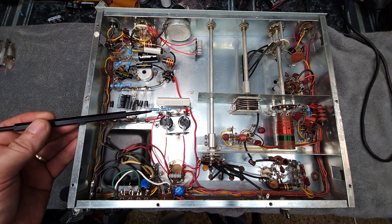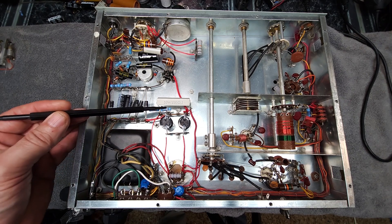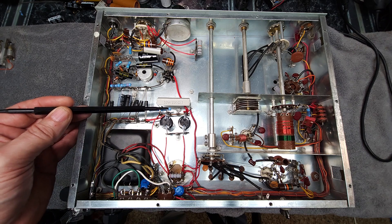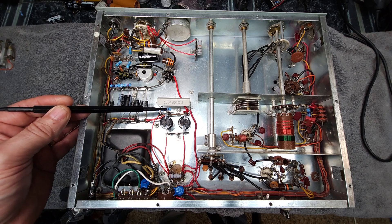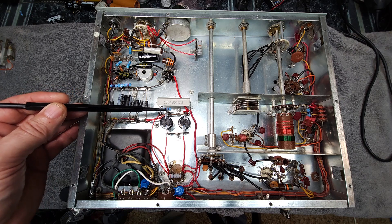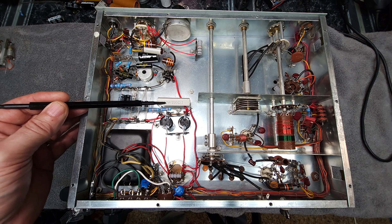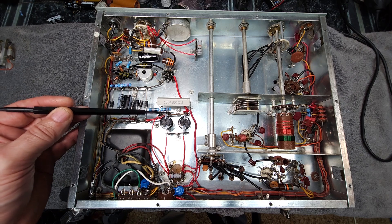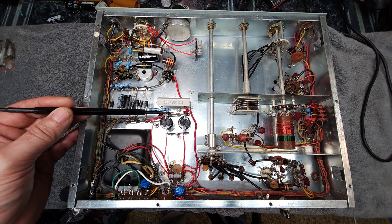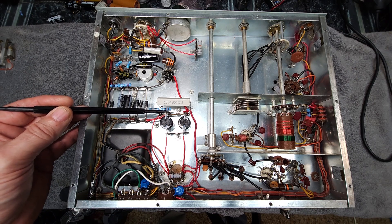Let's come back to these couple of resistors — I think this is R37. The original kit builder had this resistor installed wrong. One end of it is on ground and he had the other end essentially on the output of the diodes, meaning he had that resistor across the entire power supply. I discovered that by accident while checking values as I go.